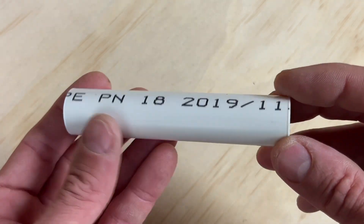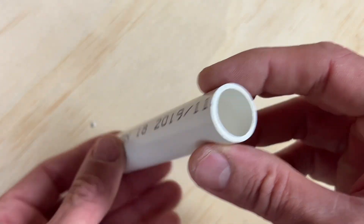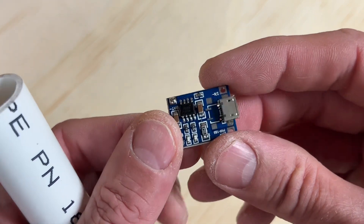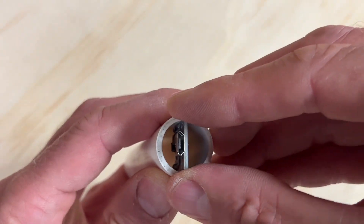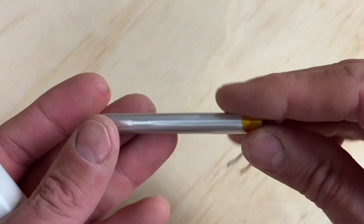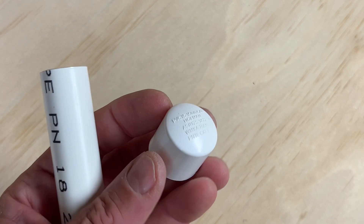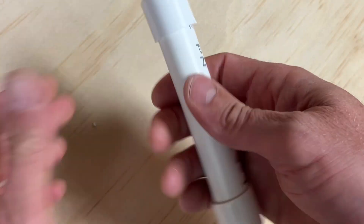The handle is made from some 15mm PVC pipe. If you're in the US you could use three-quarters inch — that would work fine as well. The hole needs to accommodate a small LiPo charger, and for the 15mm it fits perfectly inside. It also needs to accommodate a small LiPo battery, and the 15mm tube works really well with that too. You'll also need a couple of caps, one for each end — this makes up the handle.